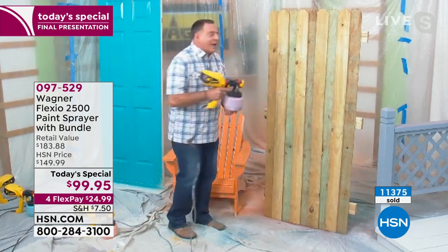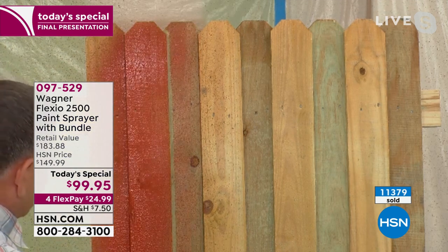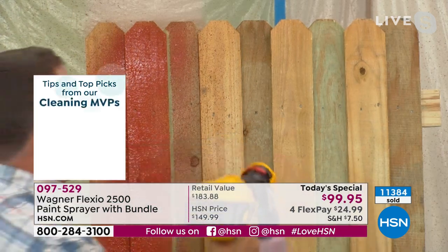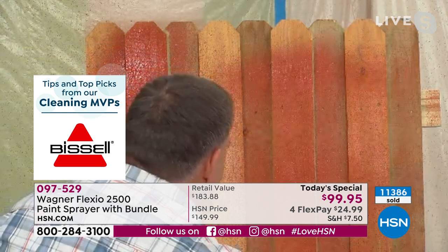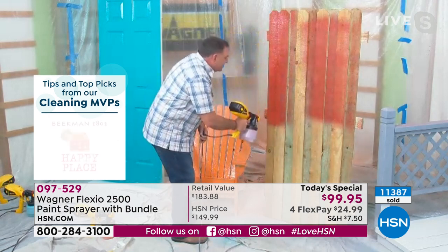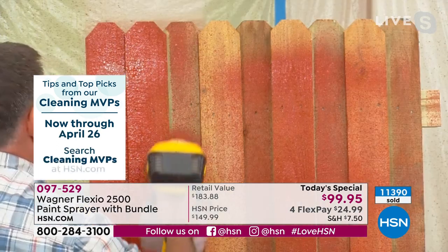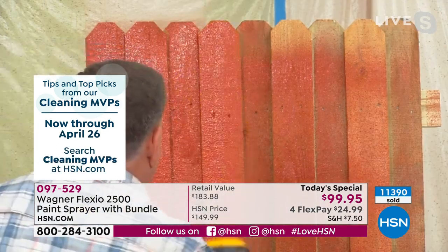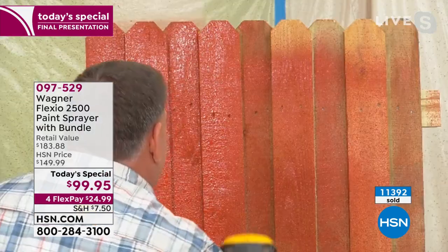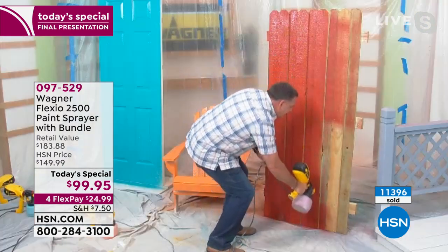What I'm going to do is put stain on this fence and this is raw wood — raw wood sucks up anything you put on it. First I'm going to do a narrow pass — watch this. You can see I'm doing like two or three boards right there. Now I'm going to adjust to the wide stream — see the difference? Now I'm doing three or four across. Now I'm going to paint the whole fence. Normally raw wood would just suck up stain and you'd be a really long time going over and over again. But I'm essentially doing one pass top to bottom, laying out a really nice complete cover of stain as I go up and down.